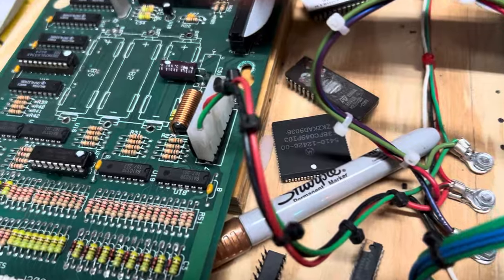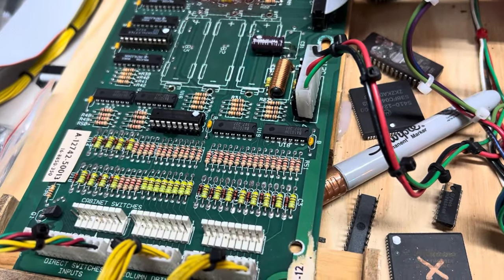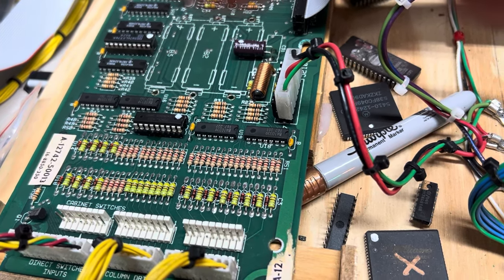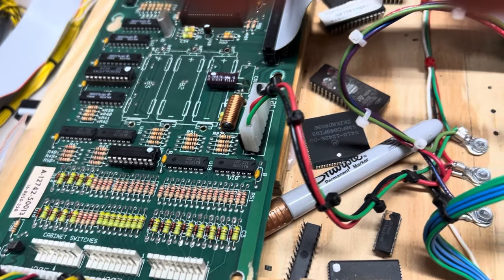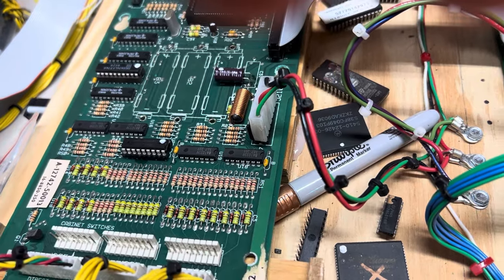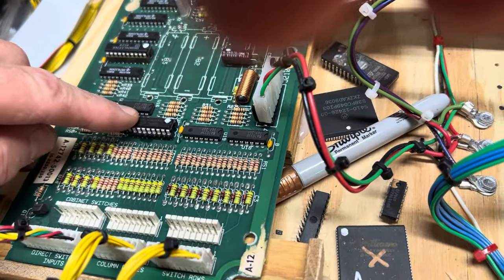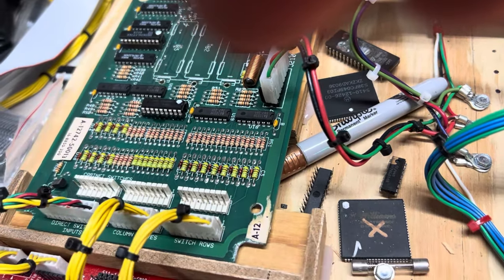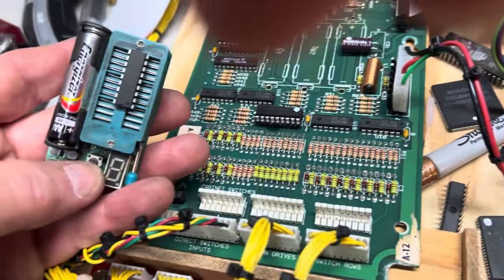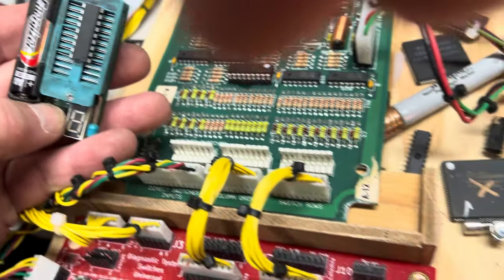The failure of the driver board was a 70-volt coil that had worn through its coil wrapper. I put a picture of this in — it shorted the switch matrix and blew U20, and then going further upstream it blew U14. Now this is the ULN2803 that I've got in my Chinese tester and it says it's good.